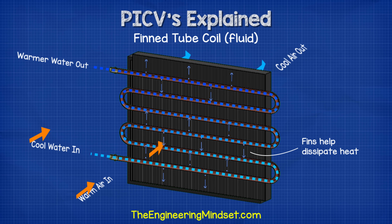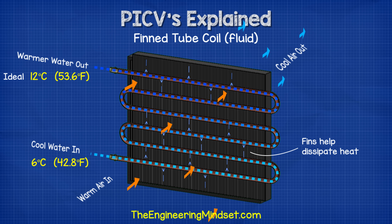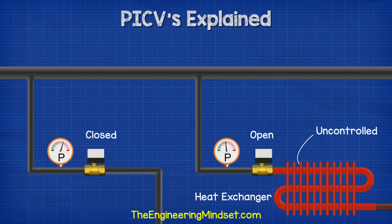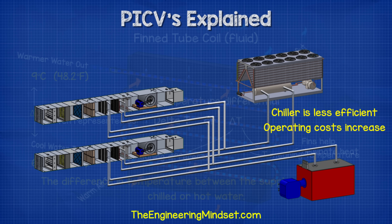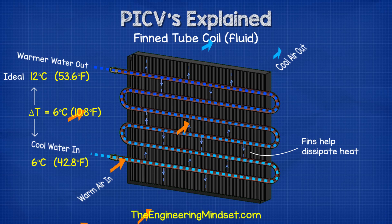Take a typical cooling coil providing cooling to the air passing over it. The coil is supplied chilled water from a central plant chiller at around 6 degrees Celsius. After this has provided cooling to the air, the chilled water will ideally leave the coil at around 12 degrees Celsius — giving us a delta T of 6 degrees, which is ideal, and the chiller will operate very efficiently. But when we can't control the flow rate and therefore the delta T on the coils, the system can develop low delta T syndrome. The chilled water might exit the coil at only 9 degrees Celsius, giving a temperature difference of just 3 degrees Celsius, which dramatically affects the chiller's efficiency and costs more to run. So we want the delta T to be as large as possible, and by maintaining the pressure difference, we can use the control valves to ensure the flow rate is exactly what we need to achieve that high delta T.